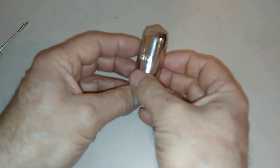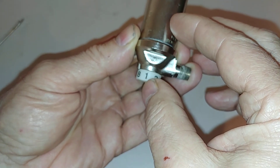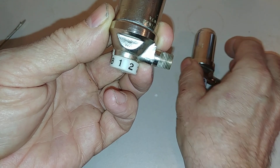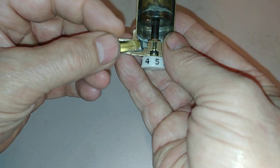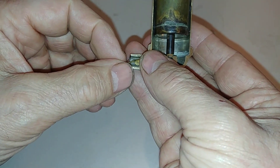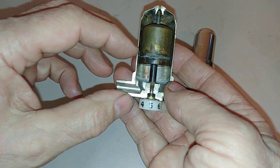We want to get a look inside here, and I've created a cutaway for your viewing pleasure. Here again is the construction — this is the 1/8-inch threaded joint which you thread into the radiator. This is the cutaway; the tongue would go here and allow the passage of steam into the vent and the water to bypass it, so it's not carried up into the hole.